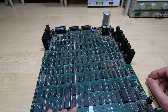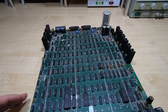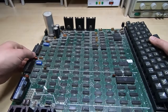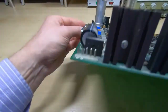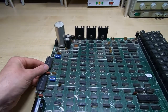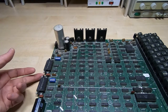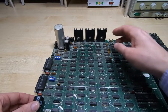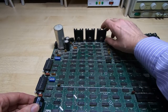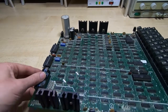There's no guard on this keyboard, so it could be full of junk. I need to have a good look around and figure out if there's anything obviously wrong. I'll measure across the supplies to make sure there's no shorts. There are some tantalum capacitors on here, plus the large electrolytic at the back, so I'll need to test that. Because the board is so big and flexible, you'll notice it flexing — quite often the pins can snap off these components where they join the board, so I need to check all of those.